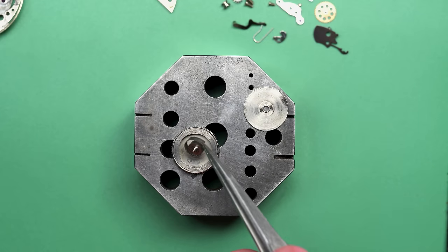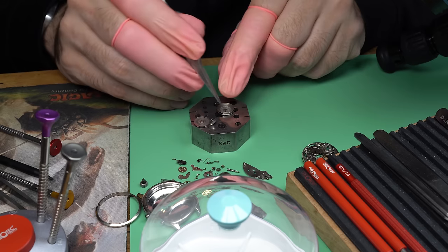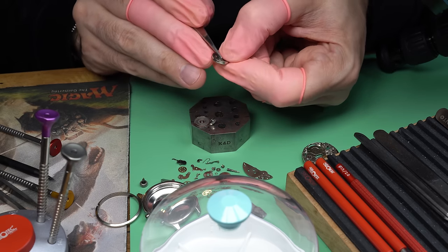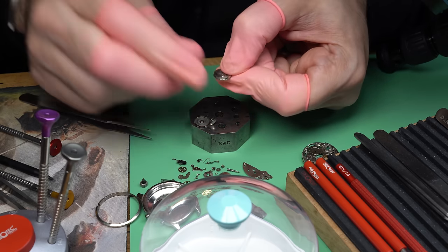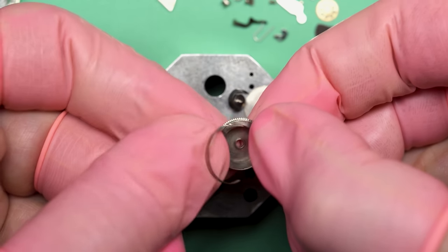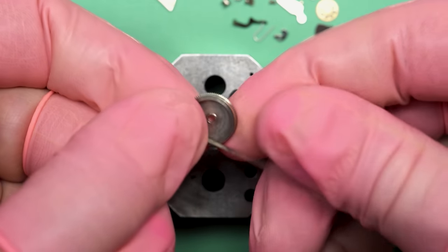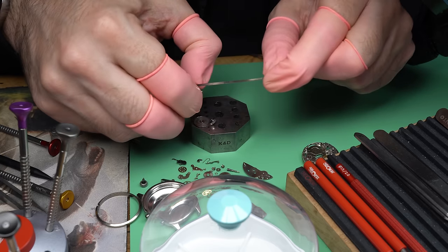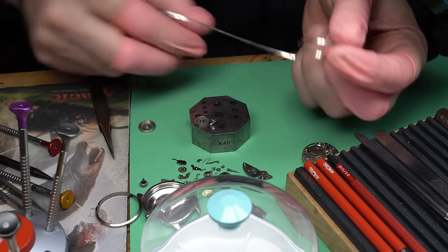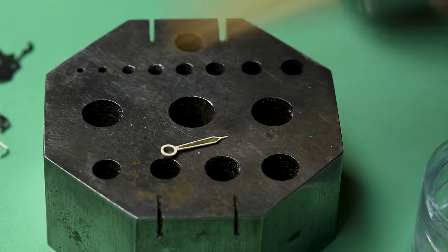In this case it was the most obvious answer to the problem — you can see it's just broken right there in the middle. Probably this got overwhelmed. That's what happens when you wind your watch — it gets to the end of where the hook stops it from going any further, and then you kind of keep going, push it a little too hard. An older mainspring can become brittle over time and sure enough, it can just snap like this one did. The rest of the spring actually looks like it was in pretty good shape too.